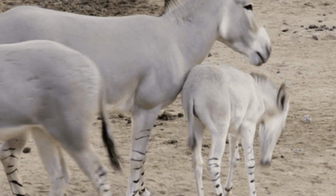I had one that was behind a couch, and it took us forever to figure out where this GFCI is. And so that is how we are able to fix these GFCIs and to have these problems taken care of. So again, GFCIs are to help keep your house from burning down. They can be a pain in the butt, and all it is basically, if it goes to ground, it's going to trip it, and a lot of times it's going to trip it way before it ever trips the main breaker.